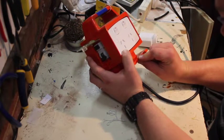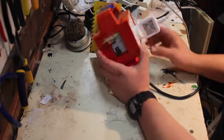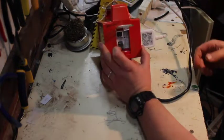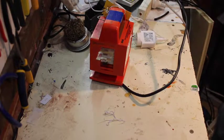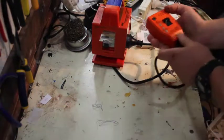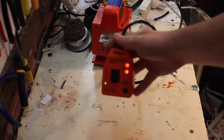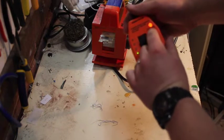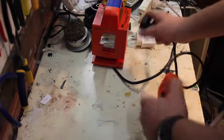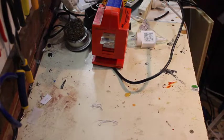It's got a date mark here — made in 2011, fifth month of 2011. So it's not an old one. It hasn't been sitting around, and it works in that power comes on when you turn the switch on and goes off when you turn it off. This here is a power point tester. The top two lights mean both neons on — correct wiring, proceed with test. So this is confirming the wiring in the shed is good. We've got earth, active, neutral, power — all okay.